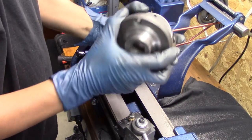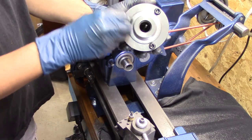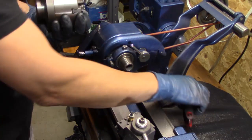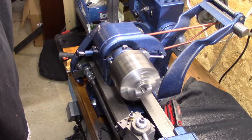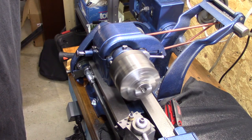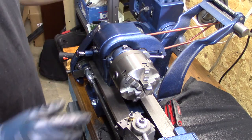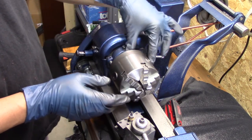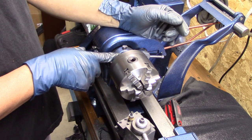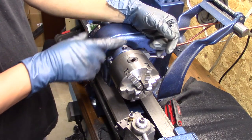Time to put it onto the six-jaw and see if we can make this thing sing. Well, I could see there's a wobble in this chuck — I'm looking down here at the register, and I didn't quite get that face to where the register was dead on. So I got to take the faceplate back off, get it back in the four-jaw, and square that away.